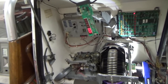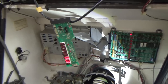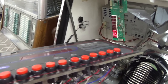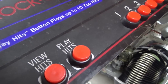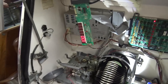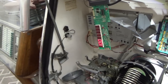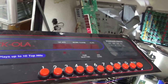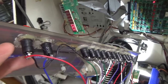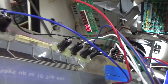This is a big problem — people run into it all the time. That keyboard is very similar to the CD boxes too, the Laser 2000 and the CD 3000. So we thought, why not just drill holes and put a bunch of buttons on it? That's what we did — drilled holes through the original spots and just put buttons. We got one a little crooked but it doesn't have to be perfect — it's close enough to perfect for me. We put a little silicone on the back so they don't come off, then wired it all up and made a new connector. The old stuff is still there but we're not going to plug it in.